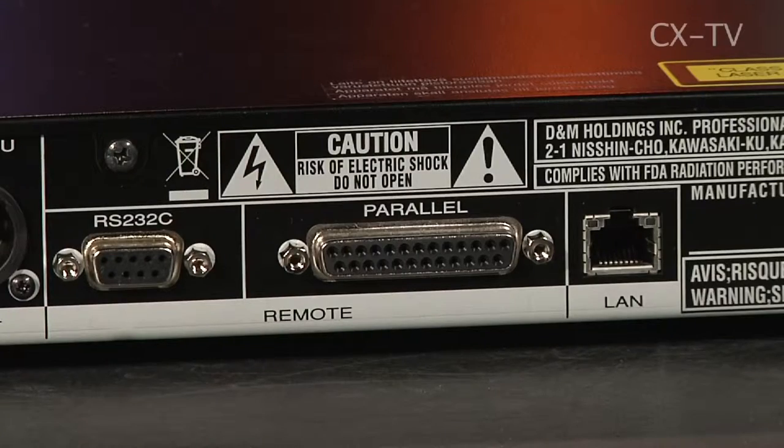Going to the front panel to set an IP makes sense in isolation, but the issue comes when you're using multiple units on serial interfaces. If you plug your PC into a device, you want to send a command and have it tell you who it is — and it won't do that. It also won't tell you, surprisingly, the number of tracks on a CD or DVD you've inserted, so from the serial interface you can tell it to go to a track that doesn't exist and you can't program it to prevent that.